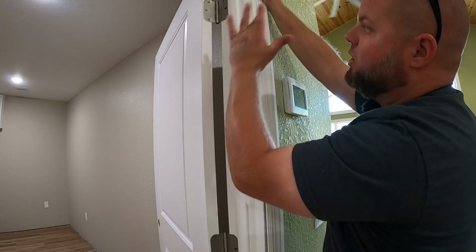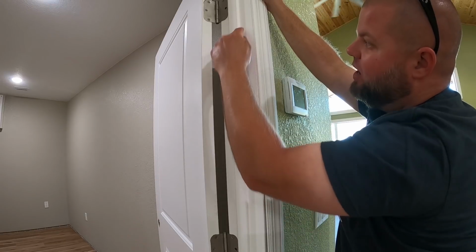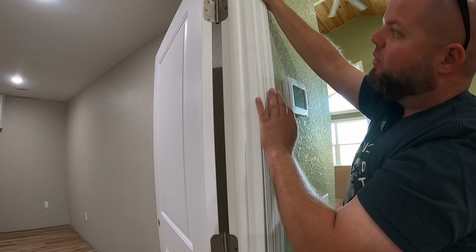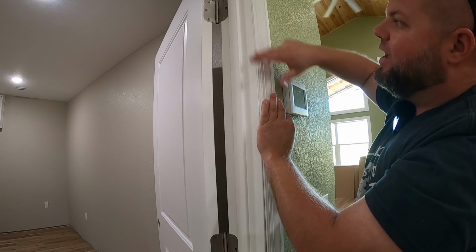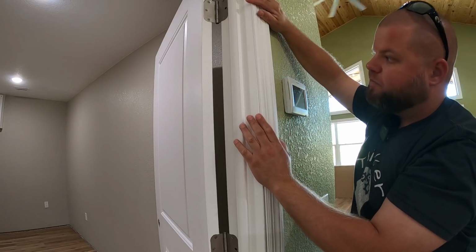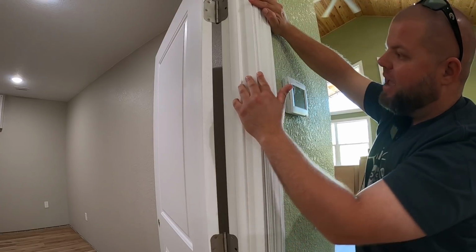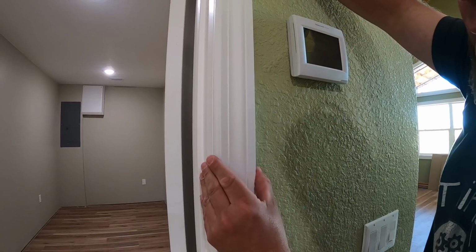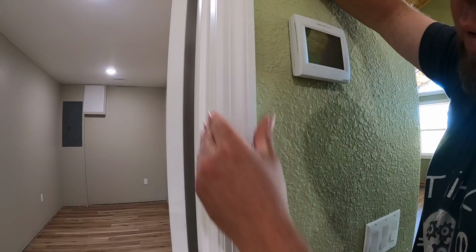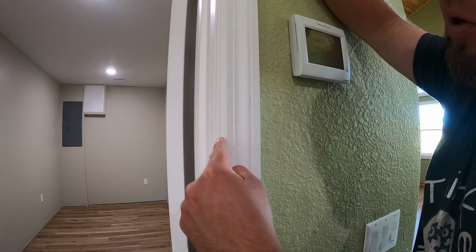And if you put this trim perfectly flush with the door, when you try to run your caulk gun down it, it'll be all over the place. You wind up with excess caulking out there, you have to smooth it all out. It gets all over the place, it's a lot of extra work. But if you actually work your trim back from the edge, hopefully y'all can see that. So let me show y'all right here. So this is the trim, absolutely flush with the door. If you work it back, say about 1/4 of an inch, I can still nail into the door frame.